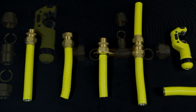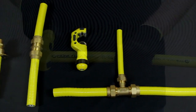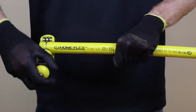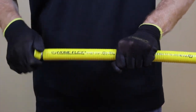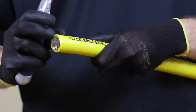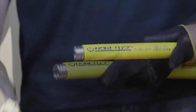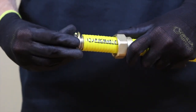With a variety of fittings for nearly every application, you can choose the perfect fitting for the job every time. Fittings are easy to install. Simply cut the pipe along the valleys of the corrugation with the HomeFlex CSST Tubing Cutter. Remove the sheathing with a blade and slide on the nut. Get the supplied clamp ring and clamp it over the last corrugation of the tubing to keep the nut in place.